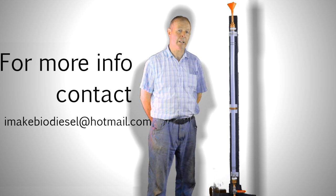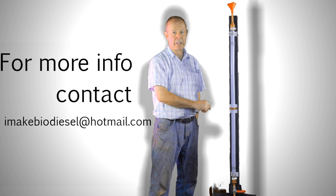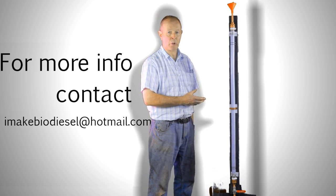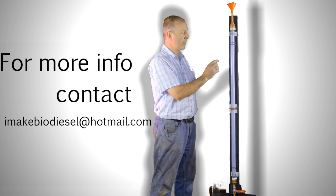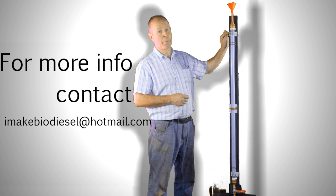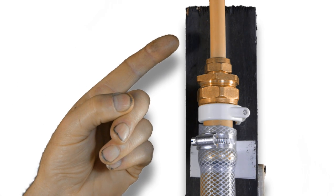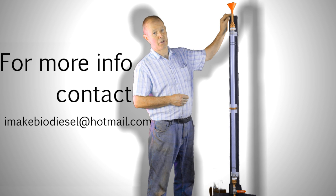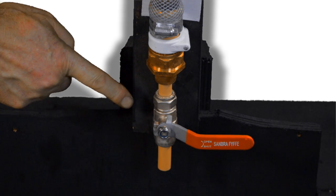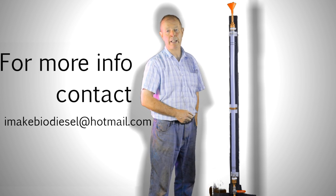Just to take a moment and see how the viscometer has been constructed. The main tube is a piece of PVC transparent hose — the same braided hose I use on my biodiesel processors — and it is one inch internal diameter. At the top I have a short piece of one inch pipe, an inch by half inch plumbing fitting, and then a short length of half inch pipe. The same arrangement is at the bottom, but this time I have fitted a half inch lever valve so that I can shut it off and contain the liquid in the tube.